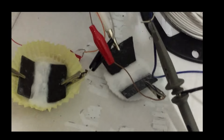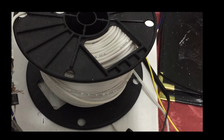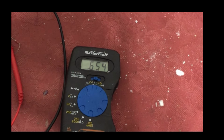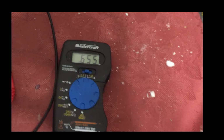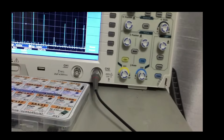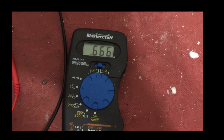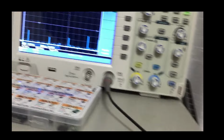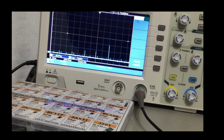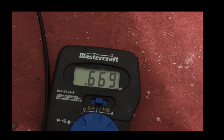And again, just these two cells here charging this capacitor, and we're pulsing the capacitor in the coil and just measuring the inductive kickback spike that we could charge like Bedini would do batteries or other things, capacitors, dump them. So that's good, a continuous rise there. And over here we're now 6 still. 6.4. Alright, so still rising. And now I'm getting peaks of 7.4. I had to change the scale a little bit. 7.4, 7.5. Wow. We're still going up.